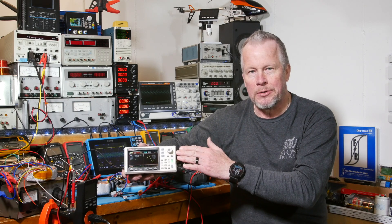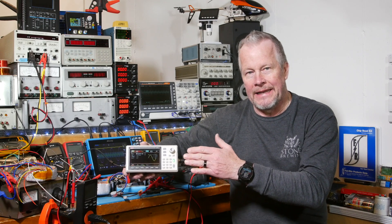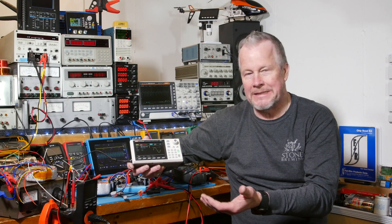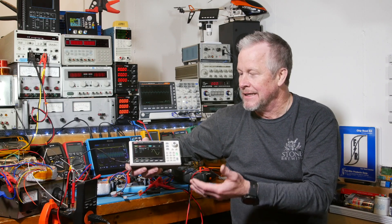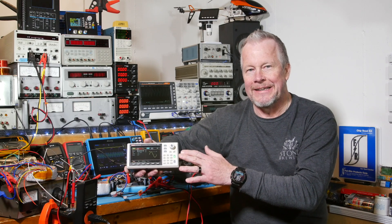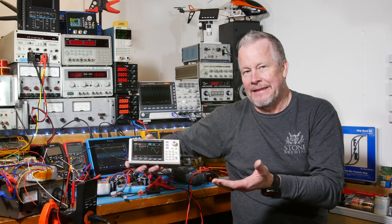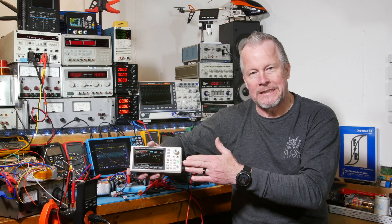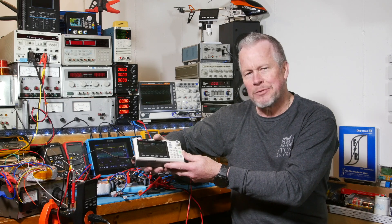If this is putting out 0.1% and the output of the amplifier is 0.1%, sounds like the amplifier didn't add anything. So we want to know what this guy's adding, or what this guy's injecting into the input signal. And then with the amplifier, we could pretty much subtract what this guy's doing.